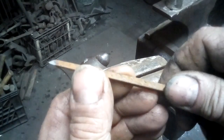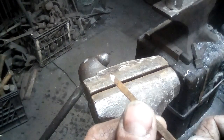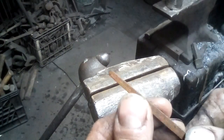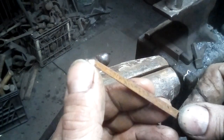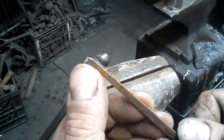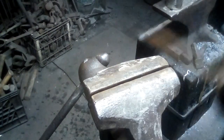And then I have a back bevel right there. That's the back bevel that's at a different angle, so that if you look at the intersection between the back bevel angle and the side bevels, that doesn't follow the line of the chisel. It's actually down past center.